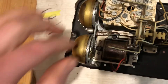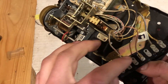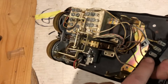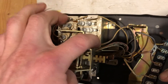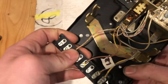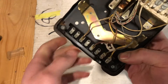The brown, yellow, and slate wires — if you have a 1A2 phone, these are used for line cards. For a single line phone, those are used usually to bridge over to C, as a sort of double protection. But for this phone, they actually have two sets of swing contacts, which is what I found interesting. So you have your brown, yellow, and slate wires used for speakerphone.